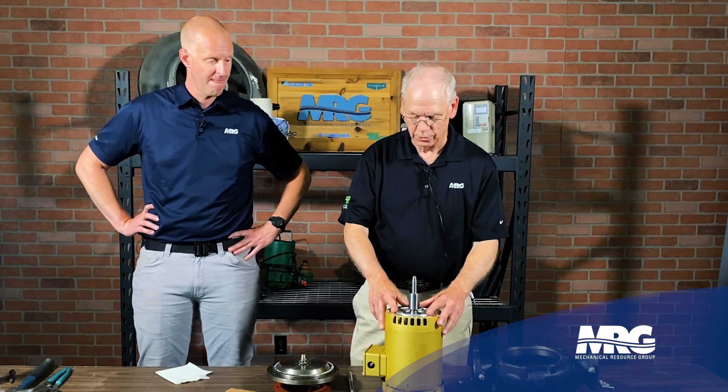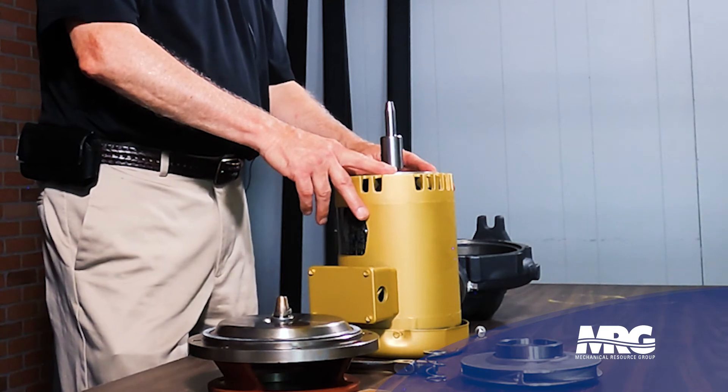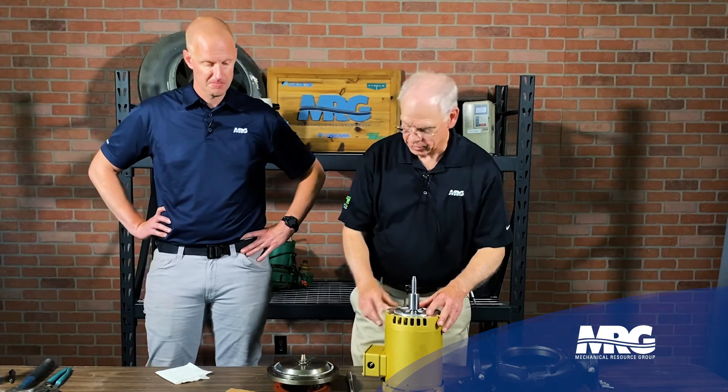Or if you've had low flow or no flow conditions, the water will heat up in the pump. That's when you valve off a pipe — say you go into a system to do a repair, you shut the water off and turn the pump off. You make your repairs and then turn the pump on but don't open your valves — you have no flow. The energy the pump generates transfers into the water, and that water can heat up above boiling point in the pump.